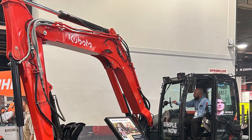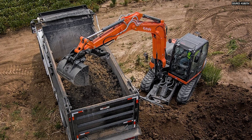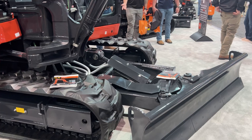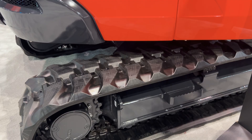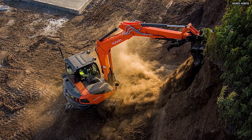It's a small enough footprint to get into most residential lots, but it's got the oomph to dig a basement or run septic fields — those things will move a lot of dirt for a small footprint. You've still got the straight blade or angle blade option. On tracks, you have rubber tracks as standard, with options for steel tracks, steel wide tracks, or steel tracks with rubber bolt-on pads — so we can add that versatility to the machine.